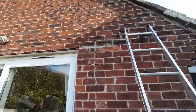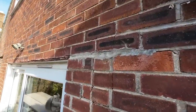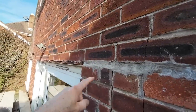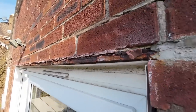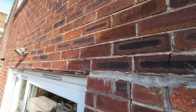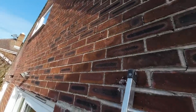And you can see the size of that joint. There's your classic lintel jacking. If your windows or doors look like that, not necessarily that bad pointing, but a big joint either side of your window, that's what's happening. And there's the lintel doubled in depth, and someone's put a bit of mastic over it hoping that'll fix it. And there's the crack. It just follows the path of least resistance. So basically the whole pier has been lifted up slightly.